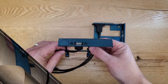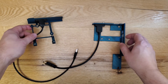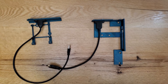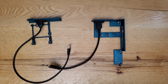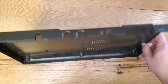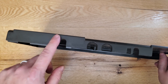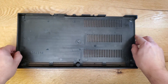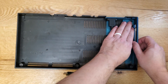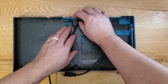I also printed some 3D custom plastic components to fill the open back ports in the housing and hold the USB and HDMI ports in place, with brass standoffs melted in for the Pi to screw into. For these printed parts I first found some files online but ended up rebuilding them in Tinkercad to fit this machine specifically, since there's no cassette port opening on the back left, so I had to move one of the ports over to the right. Tinkercad is a free website — it's worth your time if you're into 3D printing. You can build simple 3D files without learning a complex interface.